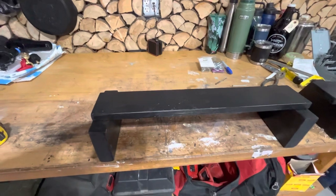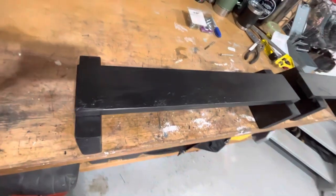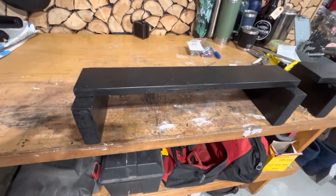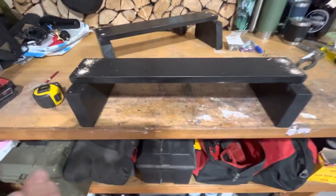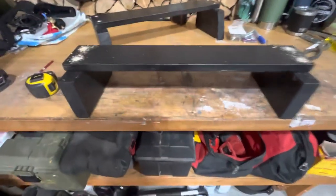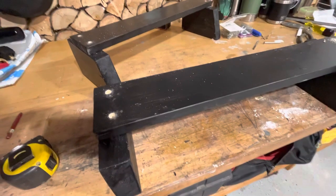I've got the skis all drilled out and countersunk. Now it's just the base pieces I need to do. I pre-primed these earlier and I'm going to countersink the screws going down on these as well. I just happen to have a couple of deck screws that'll work for this 1x4 — it'll be very secure for the weight on it. One of them is done and the other one is pretty screwed. One of the things to take note when you're building things like this: keep things as square as you can. I squared off the corners of each — the skis are going to be set square so your toboggan pulls nice and straight and true. An additional bonus of countersinking is that it prevents your wood from cracking. You worked this hard, you don't want it wrecked by some cracks.